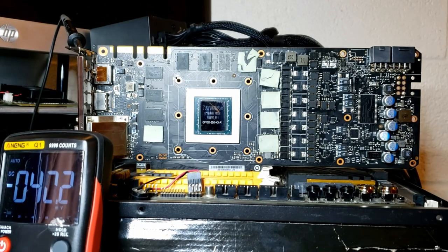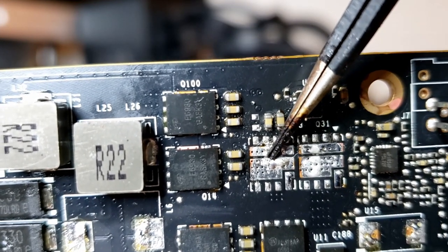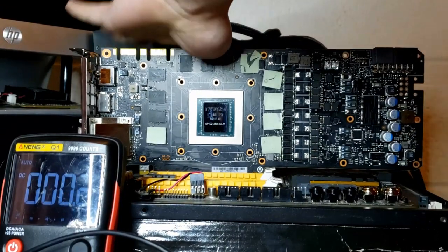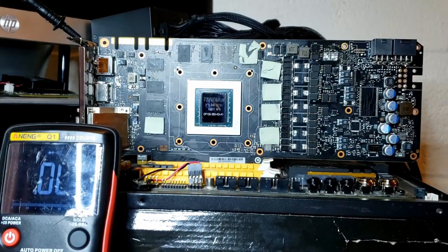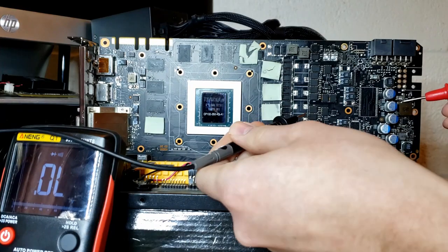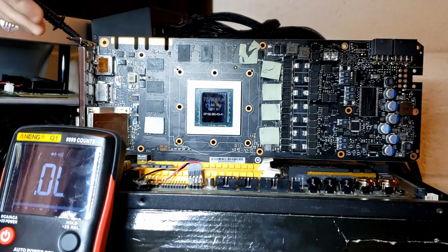I've taken off the two MOSFETs. I'm rather sure we know which one's bad — not only was one burned, but you can see it was burned in such a way that it actually took a piece of the PCB off. In this case that's fine because we still have most of the pads, so electrically there's no noticeable difference — the MOSFET will still receive power. Let's now confirm the short is gone. With my multimeter in beep mode — yeah, we don't have a direct connection between 12 volts and that pad. The short is gone, which means we should be safe to reinstall everything and test it.